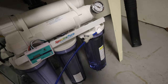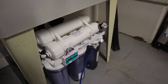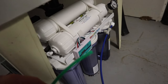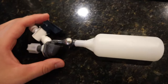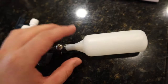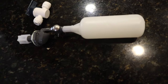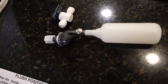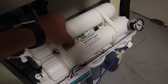The hour is almost up. I want to show you something first — this red hose is designed to create more waste water and less clean water, but it helps the filters last longer. You can install this green hose in its place, which creates less waste water, but your cartridges won't last as long. You could also install a shutoff valve or even a float valve that would go in your mixing container to automatically stop the RODI flow when full.